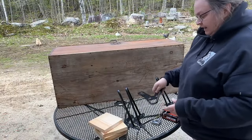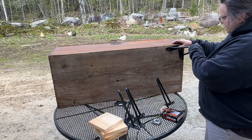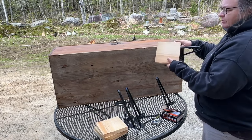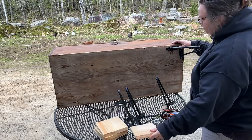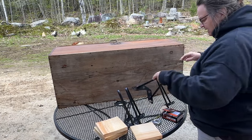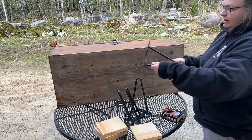Okay, so finally, here are the legs that I'm going to put on the bottom. They go in the corner here, like this. Now I'm going to take these 6x6 pieces of wood and put them inside on the bottom and screw those in so that when this goes in, it has more to hold on to, because it's only a very thin, probably half inch piece of wood there, maybe not quite strong enough to hold these legs on, you know, if it's moving and sliding around.